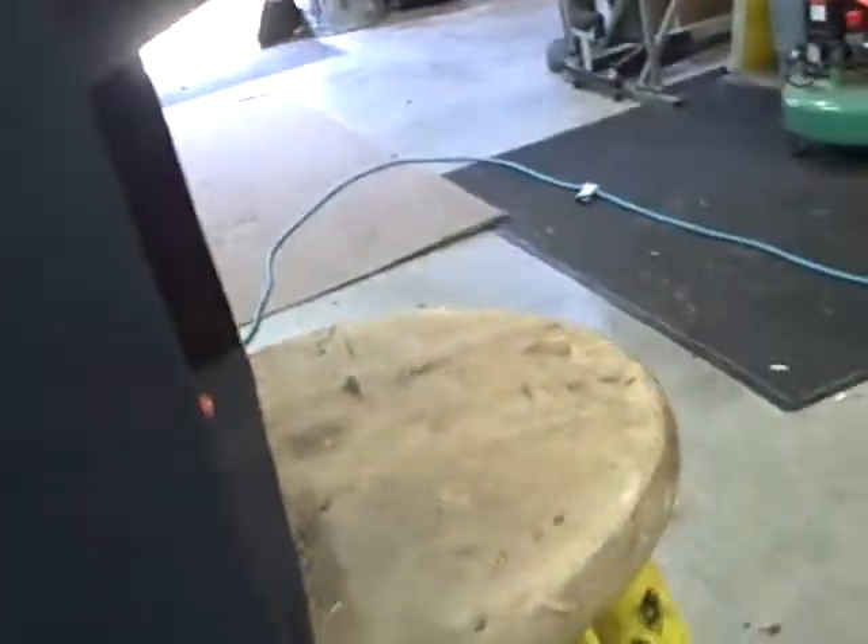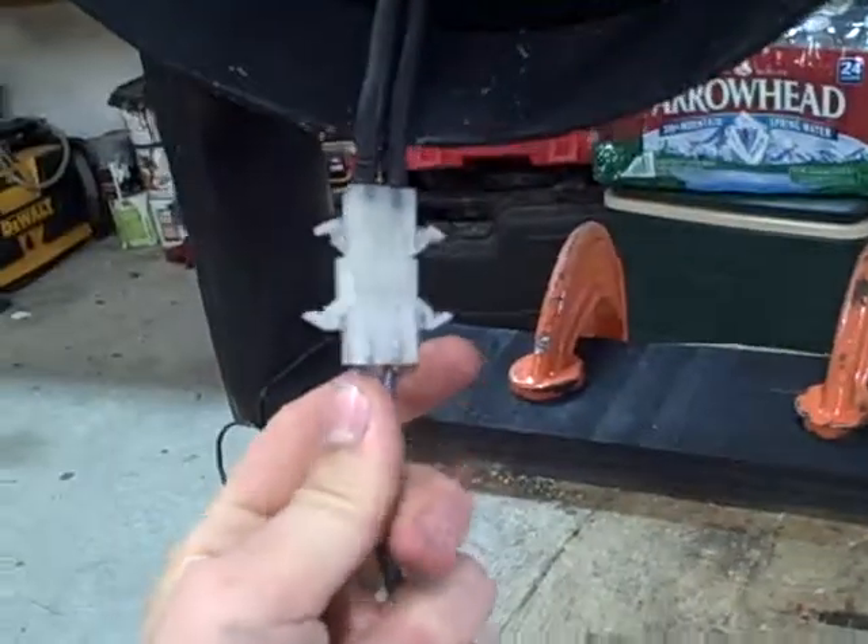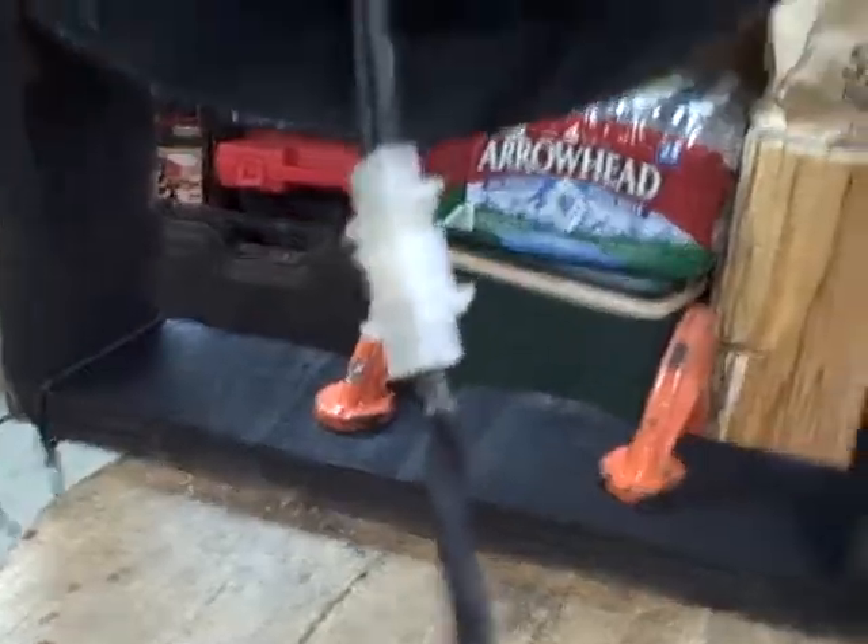This is the search lamp I've made — kind of a prototype, painted matte black, clamped on a chair on a gimbal. Power comes in the back via a molex connector. The connectors are rated at 20 amps but I'm pushing around 50. They feed into 10 gauge cables going up to a fuse bank — my diodes are only rated at 50 amps so I didn't want them to get fried.